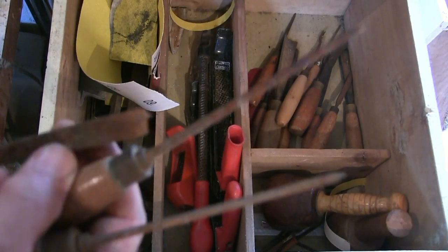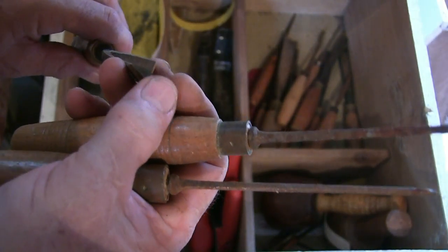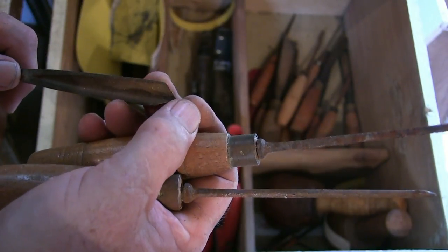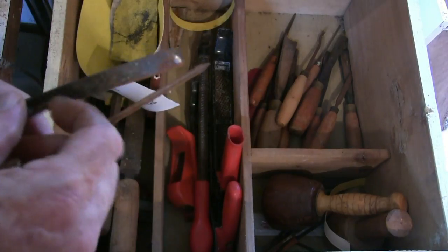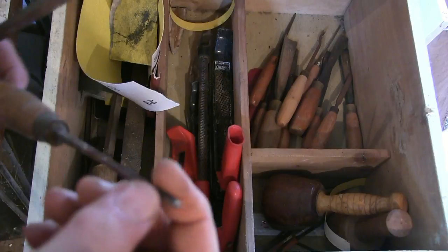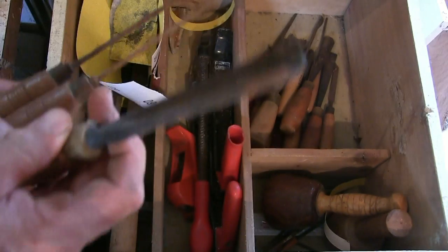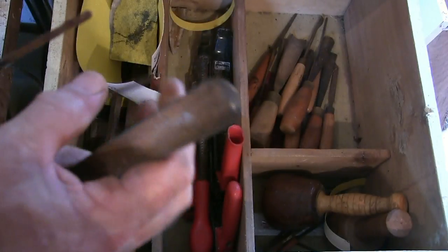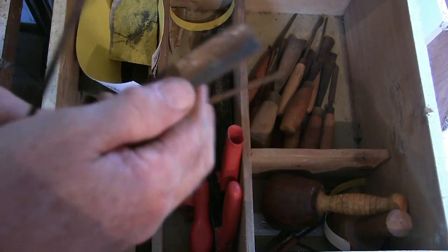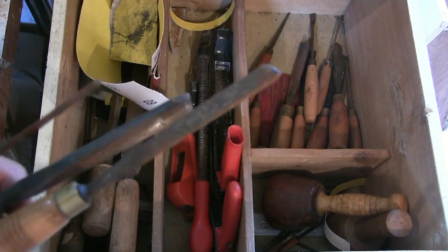This one has a V-end - it's the one for carving out letters, fine gouge marks, fine details, even little eyes or squares. We've got a smaller one too, and very small rounded gouges for doing dots and dashes. I'm going to show you just the basics with the lettering V gouge and one ordinary gouge today. We'll use a medium gouge to show you the basics of how to work with wood. So we've got a rounded gouge, an ordinary larger gouge, and I want the lettering V. Let's discuss wood now - what sort of woods we can use.